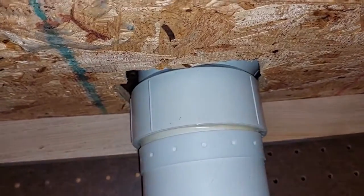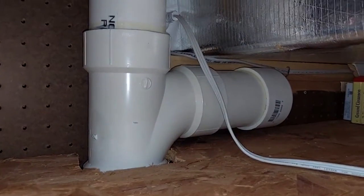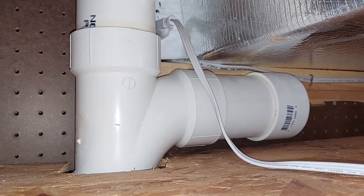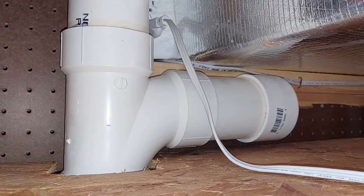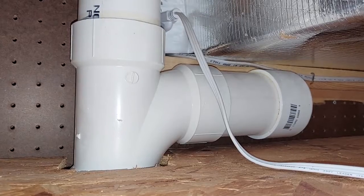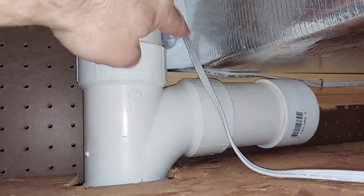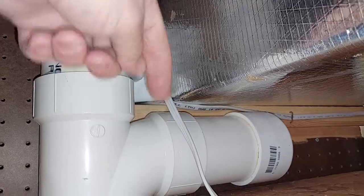I added another piece of pipe and came up through the top shelf. You can see the HVAC system right here. I split the pipe off — the reason is that our first floor is about 1,000 square feet and the basement is about the same. I put the split there just in case this single pipe didn't draw enough from underneath the floor to bring the radon levels down. I could then run the other branch along under the HVAC to hide it and drop it into the floor at the other end of the house.